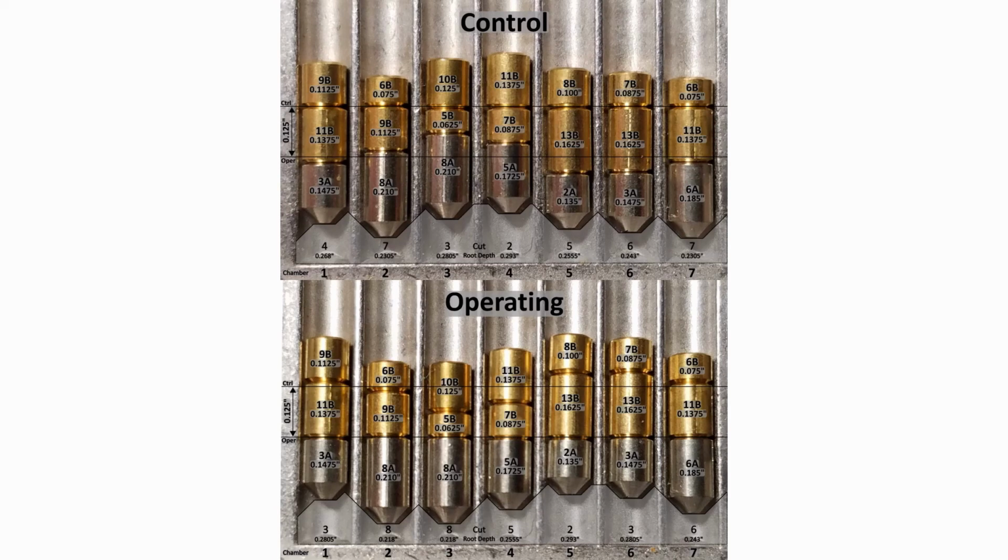Earlier I talked about having a number 11 pin and a number 10 pin here, where the control shear line and the operating shear line were identical. I've seen that in many cases. So when you get one click there, you've got both shear lines together. That makes it essentially only 6 other chambers that you have to pick. In a lot of cases, I've seen three or more chambers that have the same shear line for both control and operating. So that makes it a lot easier pick.